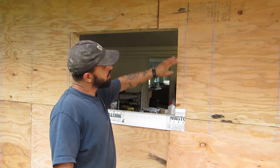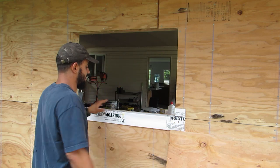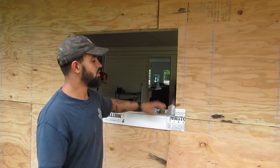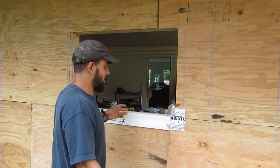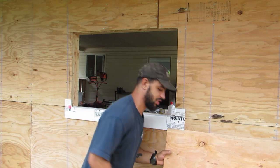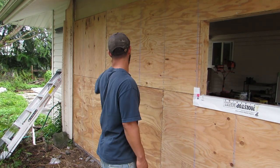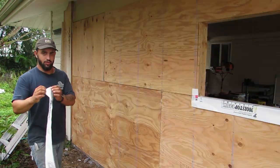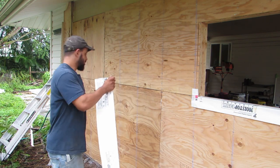I don't think I'm going to be doing the rest of this in this application. Now if you've got drywall on the inside, that's catastrophic if you get water in there, so definitely wrap the whole thing. This is just mainly — the wind usually comes from the other way, so to me it's not that big of a deal. I'll be putting flashing on the outside of the window though, even though I will be silicone-ing it. But for the inside, I don't think it matters for this application. Now I'm just going to do this seam, and if I have leftover pieces, I'll do the downward seams also. Remember, if you're using this kind that only has half the adhesive, be sure you put the non-adhesive side down so water will shed off properly.